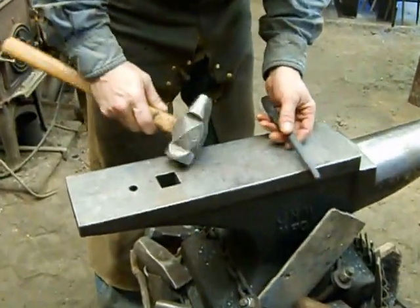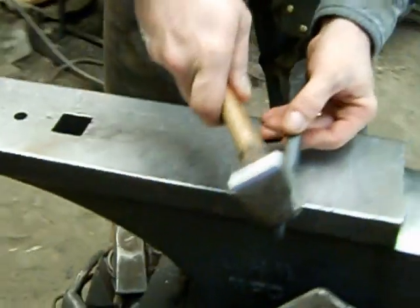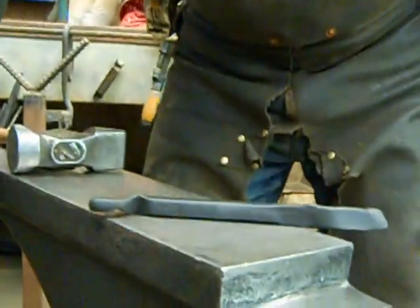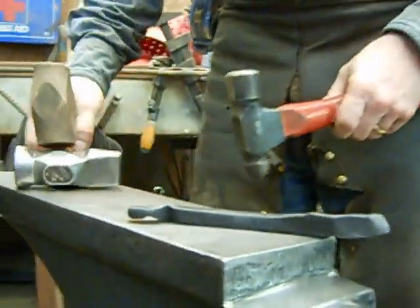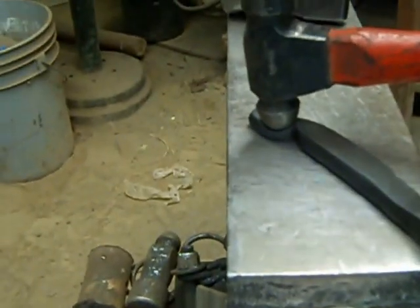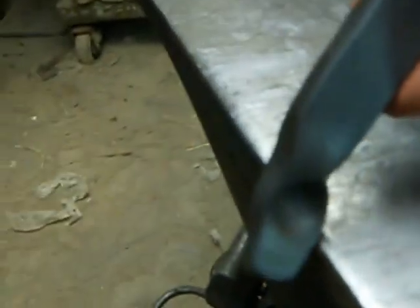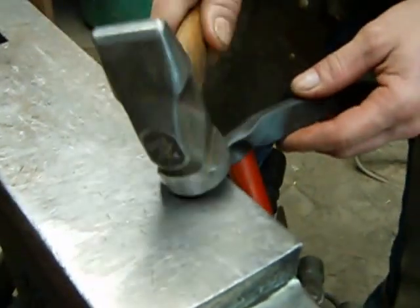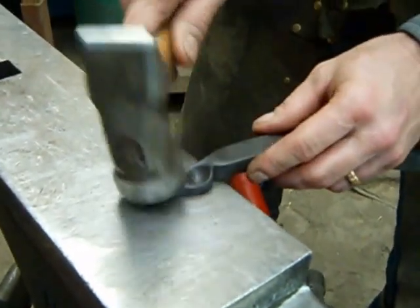You'll have to do your heats accordingly. Tapering it out on the back side of the anvil, we do a notch. I like to take a ball peen hammer to do the chin. Safety - most of you should know we never hit hard-faced hammers to hard-faced hammers, you'll get shrapnel that way. I'm using a brass hammer to make my chin, ending it down here. Some like to do another notch on the other side, but I like to work it out from there.